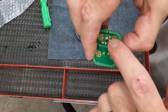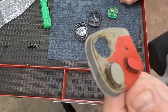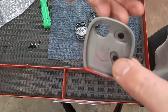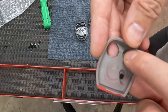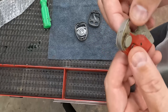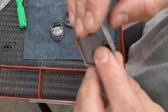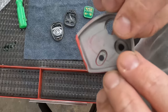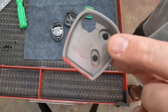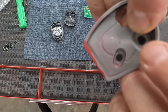What's common with these, especially the GM ones — I've had a few of these happen this way — the material on the back side wears off, or it gets smeared up with gunk. When you clean it, it's really really thin and really fragile. You can see even this button is about to pop loose; the rubber wears out, let alone that tiny razor-thin material on the back of the button. What I've done in the past is take some aluminum tape or copper tape and stick it on there.